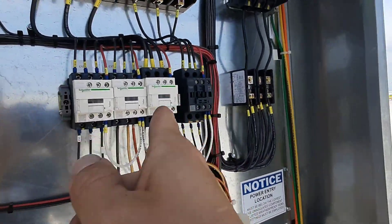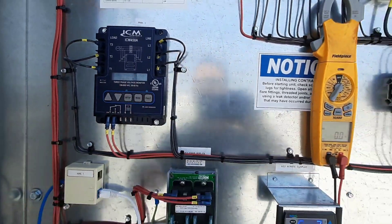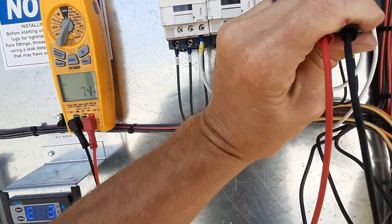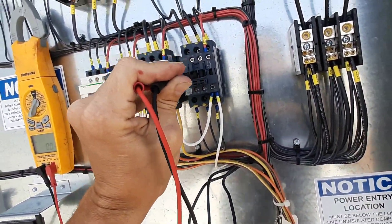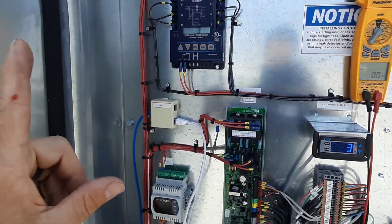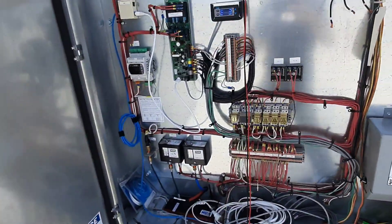There it goes — it went on its own. And you've got a fault: 'Load Phase Loss Fault 01.' That's because even though the contactor just pulled in, I'm missing a leg of power and the fault pulled the contactor back out. But no problem — get the contactor replaced, we'll get rid of the load fault, and the compressor ought to be alright. We just need to get some more refrigerant in it; from what I'm told, when they finished the compressor they dumped what refrigerant they could, so we've got to go from there.